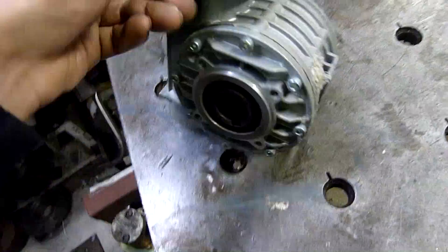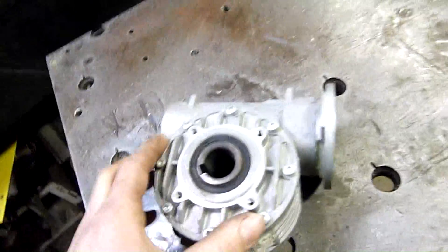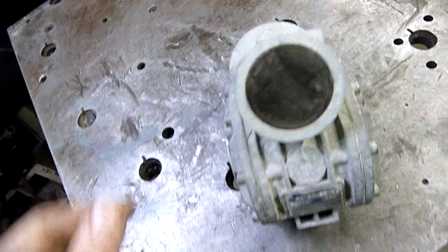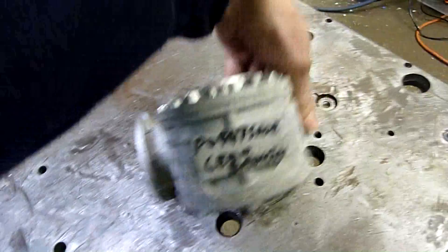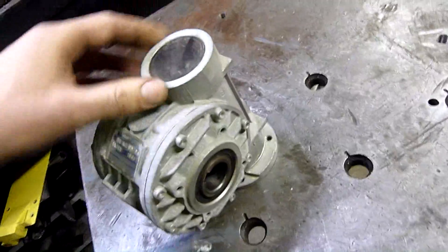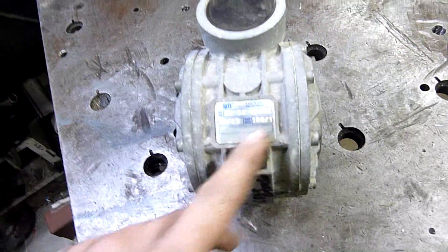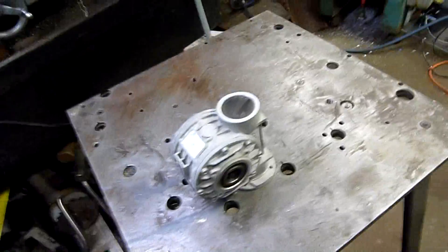That's not good. So essentially we're going to take it apart, or at least try. There's a lot of cap screws around here. The oil inside should be a water soluble glycol so it's easy enough just to wash out and dispose of. The job was called Portside — Portside Gearbox. It's an MI50, 100 to 1 ratio, so they're fairly slow — it's a very low ratio.